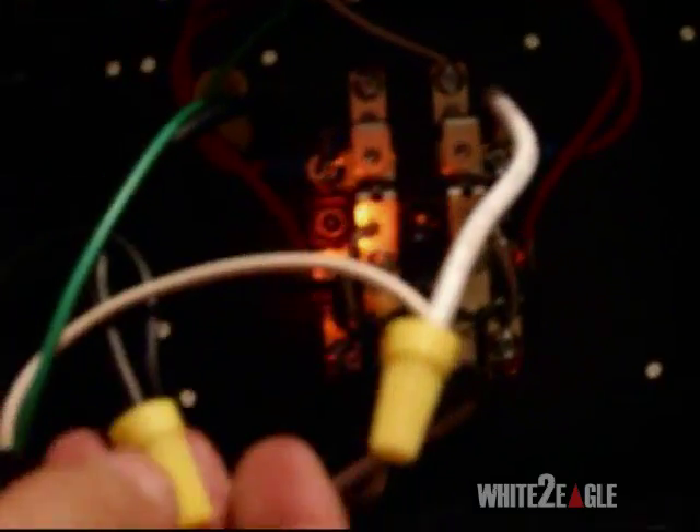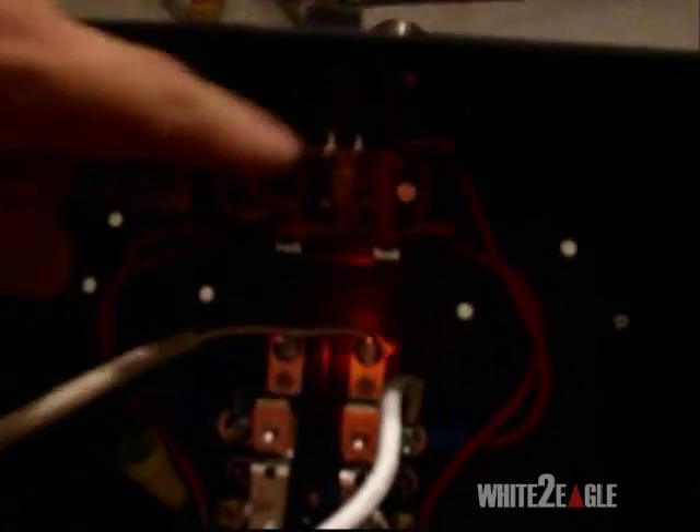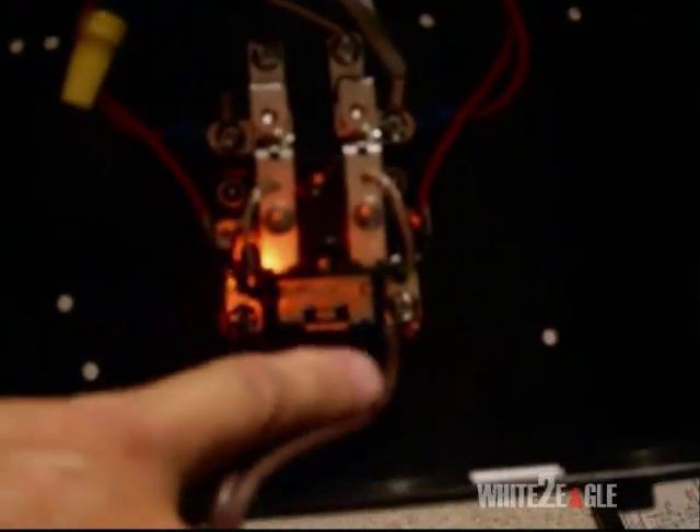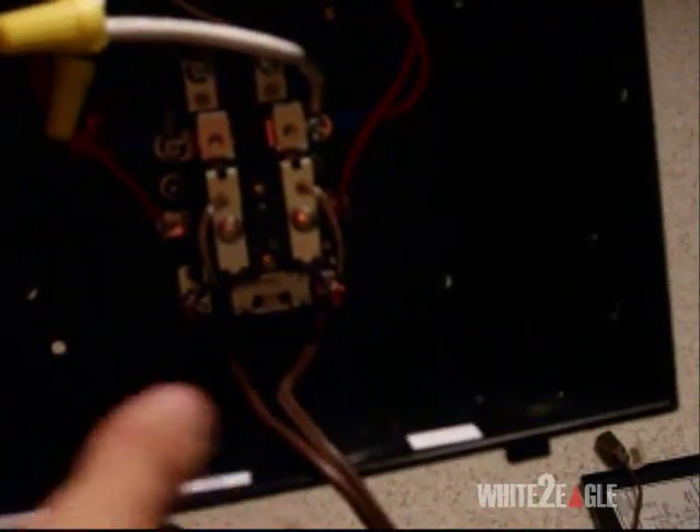I like to keep the battery as my main power. If the battery goes too low and shuts the inverter down, then it switches over to the grid electricity. Down at the bottom of the unit is where you connect what you're going to plug in as your source — I have an extension cord there where I'll plug the lamp. That's also where your 30 amp fuse goes on your panel, so you can power whatever room you're in.